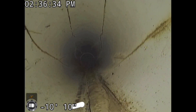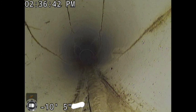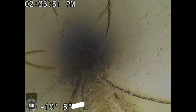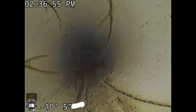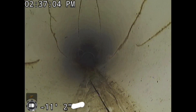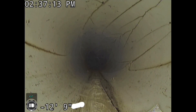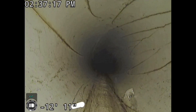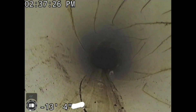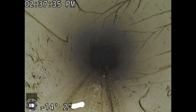You're going to see all the cracks in this pipe. This pipe is no good for the north. It has to be run on 1% slope — it can't be any greater than 1% slope or it's going to leave all the debris behind. People always say PVC is easier to install and to get your 1% slope. But if your grade is falling away and you have a lot of drop, you have to stay with the grade. If you don't drop the pipe at the 2% or 3% that the grade is falling, you're going to come out of the ground with it. It's going to daylight too soon when you're trying to discharge it further away to prevent erosion on a bank or a hill. You want to carry it further away — you don't want to discharge water up high in a grade.